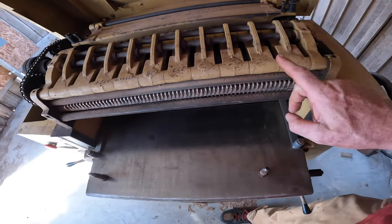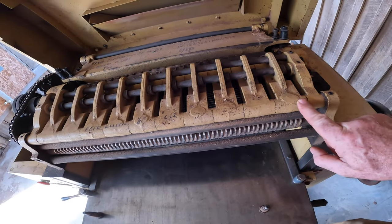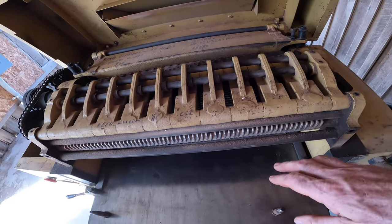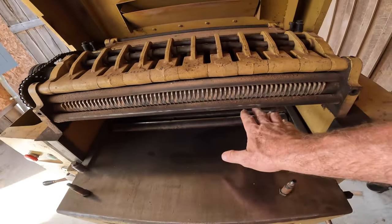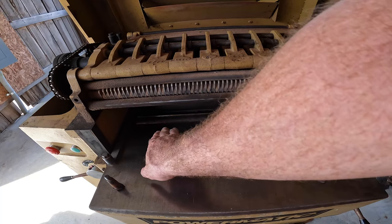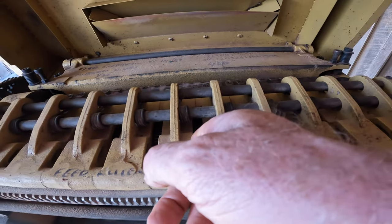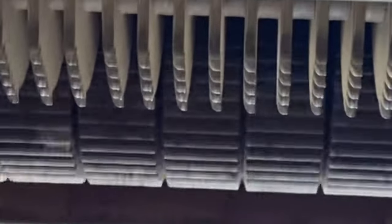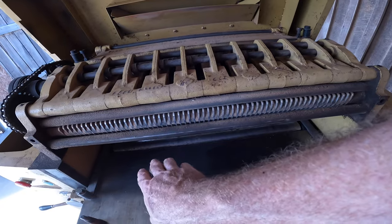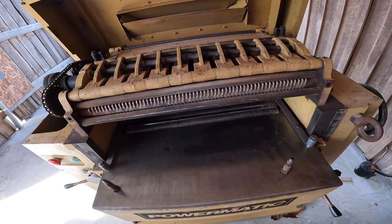The thing that you might notice is it's not one continuous roller. It's called a segmented roller. And this is typical of the higher-end single-sided machines because you can put a board of, say, an inch thick over here, and a board say an inch and an eighth over here, and since these rollers are segmented, in like 2-inch lengths, these will flex up, these will flex at a different level, these will grab the top of one board, these will grab the top of another board, and you could feed multiple boards in at one pass. The planer doesn't care.